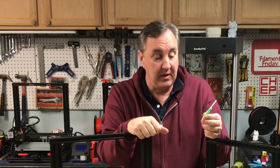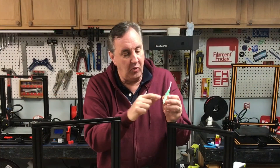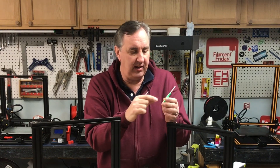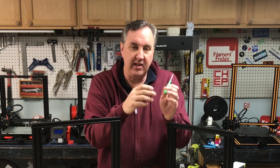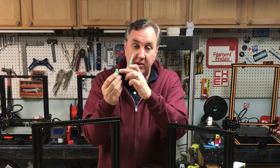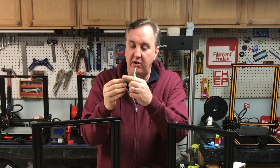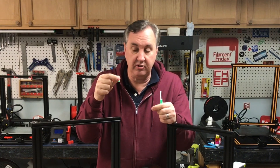You can use higher temperature Capricorn tubing for the little section inside and still use the stock tubing back to the extruder, so maybe you can get a little higher temperature printing that way. For the washer, I didn't use his design in my test — I designed one very similar in Tinkercad and it seemed to work fine, but his should be fine as well. I incorporated that into the coupling design here so I could control the size of what's inside. I'm going to share this modified coupling on Thingiverse — there will be a link in the description below.